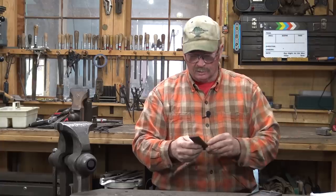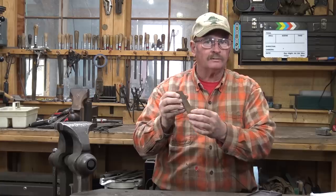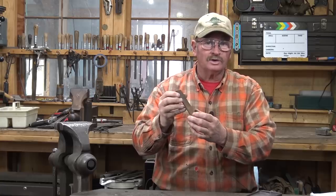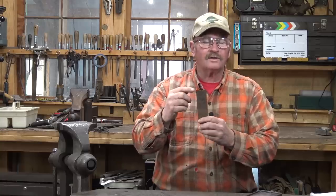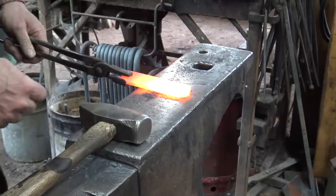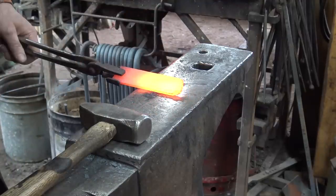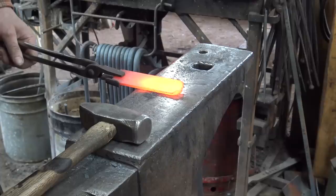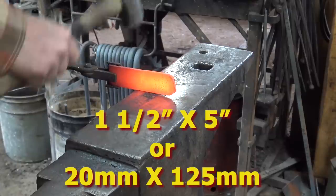But I've done a hook like that previously here on the channel — it wasn't part of this series, but I'll link to that video up here in the corner. I think I'll still go with the general plan of drawing the hook out, maybe reduce it by about half of its width, which should draw it down at least double its length. That'll give us plenty for a hook. This top piece will turn into some sort of a decorative element, just not a flower. I'm going to leave about one and a half times the width of the material — about two and a quarter inches — to make whatever finial I end up with. This is about an inch and a half wide.